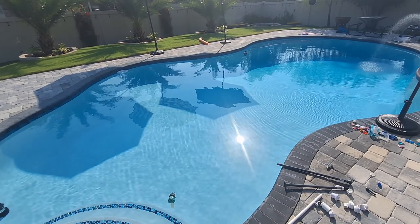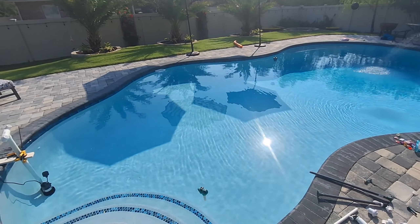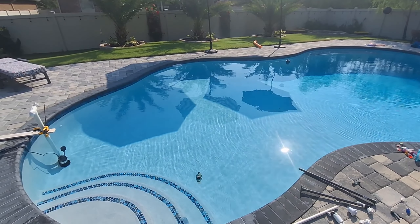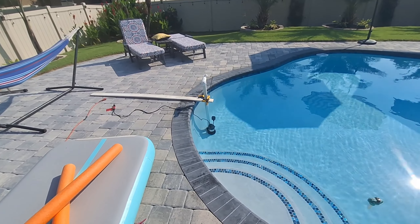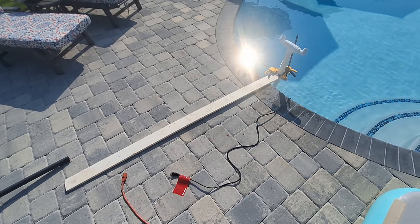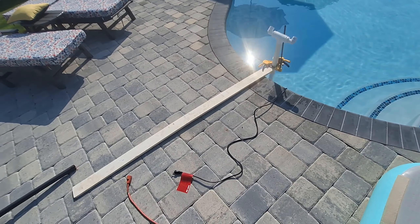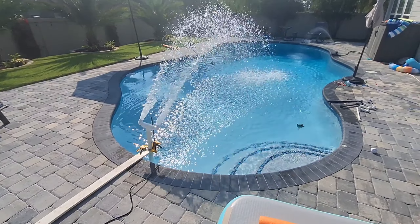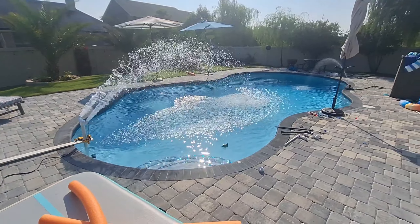When I was going back to the store I realized I had one more trick up my sleeve. When we were building the pool we had a bunch of water in the pool and the pool builder wasn't getting it out to my standards, so I got a submersible pump — it's got an inch-and-a-half outlet, rated at 4,080 gallons per hour at zero-foot head. Right now I've got about a five-foot head on it. When we plugged this in last night, the air temp on my Sutro — that little floaty device — was reading 91 degrees. By about 7:30 to 8:00 this morning I was reading 86.4, then 86.5 as the day started warming up.